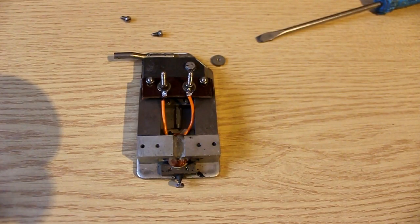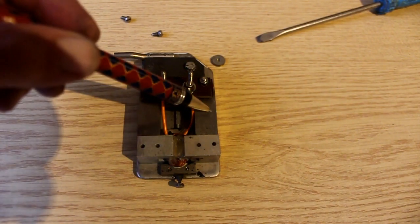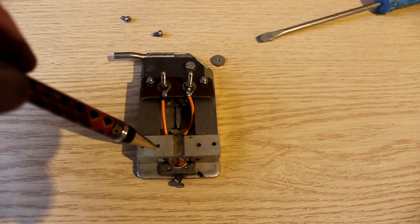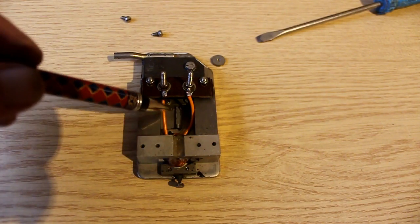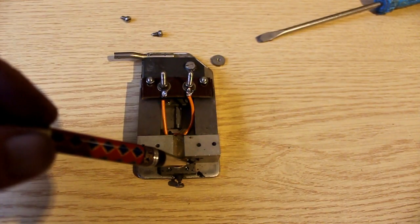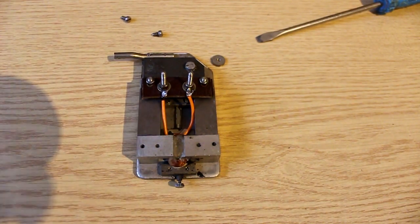The inside is extremely simple. There are two bar magnets with a joining piece at the top, and two pole pieces. The armature is down there — you can see the coil just there. These are the leads, the orange sleeving from the terminals to the coil. It doesn't get much simpler than that. So if it's that simple, why the heck doesn't it work?